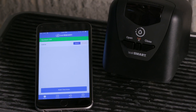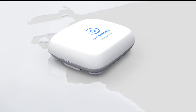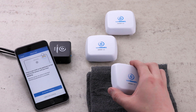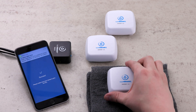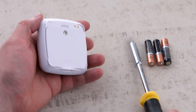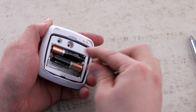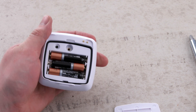When the screen reads system OK, press add device to pair the LeakSmart sensors. Your LeakSmart sensor has an audible water detection alarm even without connection to the hub. But pairing means the system will signal the valve to automatically shut off your water supply within five seconds and send you instant notifications. Before pairing, remove the battery door on the sensor and install the three AAA batteries. Do not screw the door back on until pairing is successfully completed.